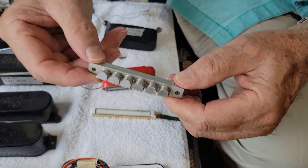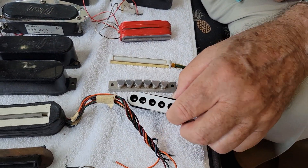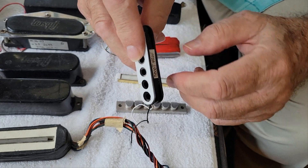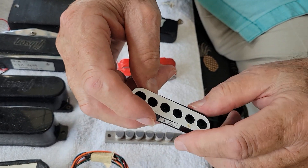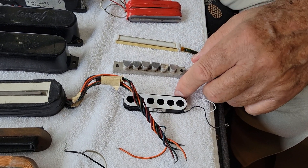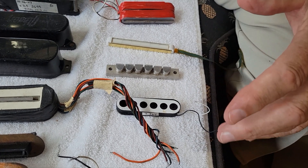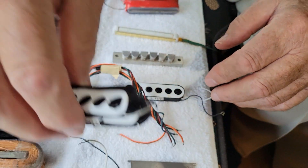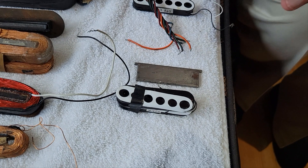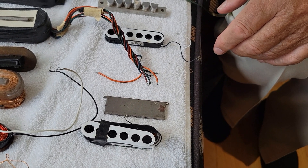Then he started getting into more high impedance pickups — now into 42 gauge wire and 5,000 turns — trying to modify the sound of what was later to become a pickup he was trying to develop, which I also helped with. He did not finish this — this is one where he did humbucking one on top of the other, but he did not finish it. Max and I were the ones who actually completed his ideas later on, and that became the Doyle Coils, as you may know.